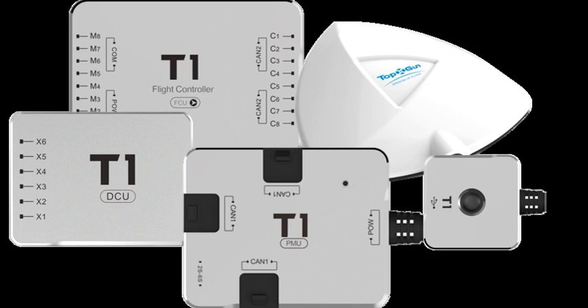Click on the RC tab to set up the receiver. Click on the RC type — it's PWM, PPM, or SBUS RX. Check the channel sequence for the given particular task by moving the switches. Switch on the transmitter, disconnect and reconnect the USB cable to start the calibration process. Tap on the Start Calib tab and move the sticks and switches to their minimum and maximum positions, then press the Stop Calib tab. Note: the remote control will only unlock after correct calibration. Please check that the channel direction is correct — this is a common problem at initial setup.